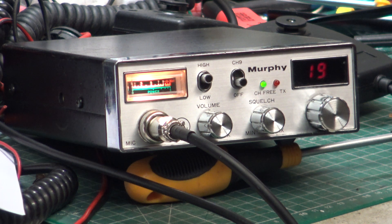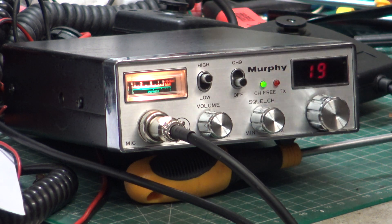You could say that if you're running it as a base station, that's down to the power supply. To be frank, the bench power supplies we use are not necessarily intended for radio use - they're general purpose. But because we changed four capacitors in it, I decided to also change the 1000 microfarad capacitor on the power input side.